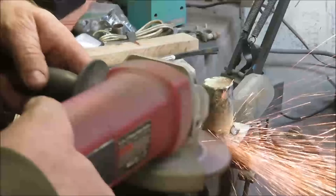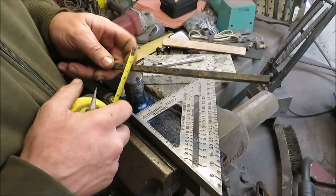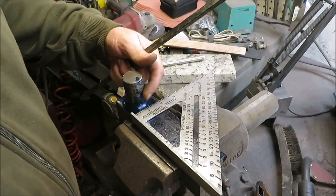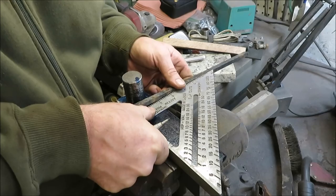Now, the last meat hook I made was made out of this steel right here. And this steel is... wait, let's see. It's 5/16 steel. So what I want is to draw a line across here, 5/16 from this piece of metal. I want a straight line across there. So we'll just lay this guy in here up above the weld, bring it down. This is just above the weld. So we got 5/16 right there. So we're going to make a mark across here.